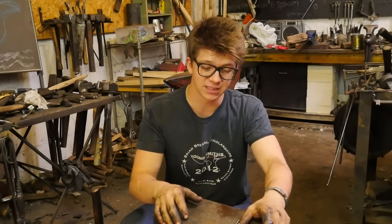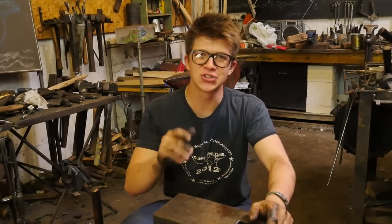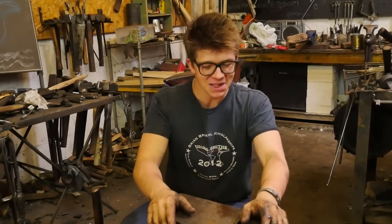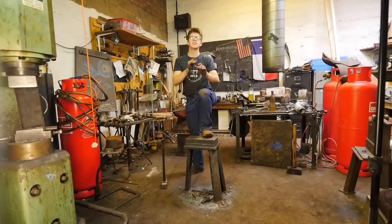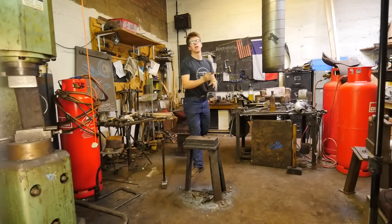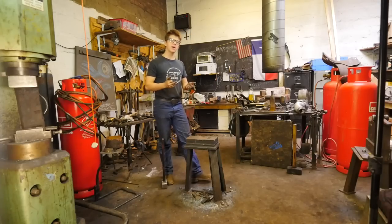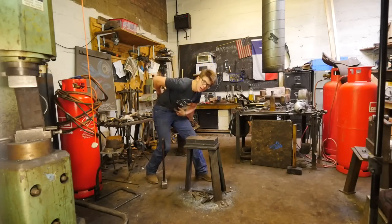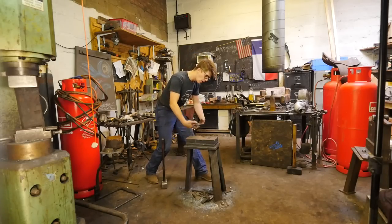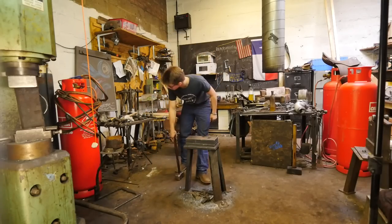The other benefit of the soft anvil is that even if you've got an advanced striker, you're still a lot safer. Safety is important in the craft of blacksmithing — anytime we can avoid losing too much of the red stuff that helps us forge, we want to avoid that. The next reason the striking anvil is great is because it is low down. I'd recommend not having a striking anvil any higher than 24 inches. It does make directing a little bit of a pain, but once you get used to bending your knees and bending over at the hip rather than the lower back, it's actually quite comfortable, and you're fine working at this all day long without getting too much back pain. For the striker, it's essential.